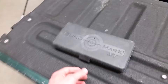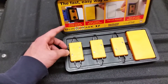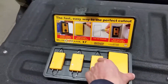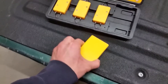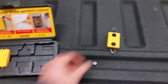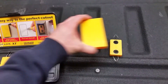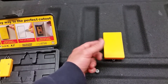How it works: it comes with a kit — this one has three little magnetic pins, so you can place them in a single gang up to a triple gang, whether it's an outlet or switch box. The magnet on the other side is super strong. You put the pins in your box, then hold your sheet of OSB, CDX, or drywall over it and feel around — the magnet sucks right through all that material and latches on.